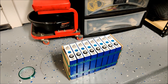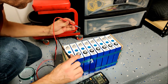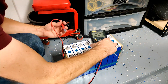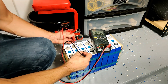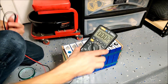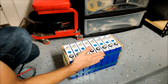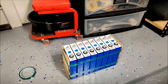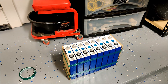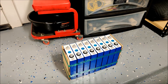Those wires have now paralleled the batteries. You can put a multimeter on the wires — 3.3 volts. So these batteries are now electrically connected in parallel, and energy is running from whichever are high batteries to whichever are low batteries. I'm going to leave this for a couple of days just like this, and that'll equalize the batteries and give me a good starting point to start charging up and balancing them.